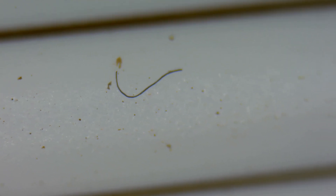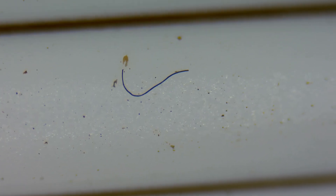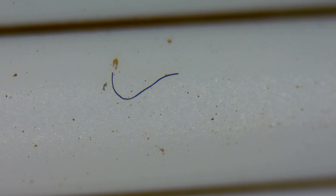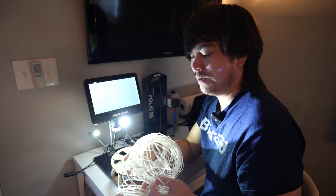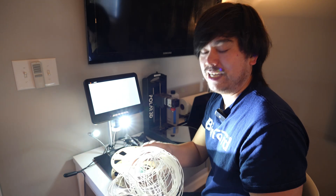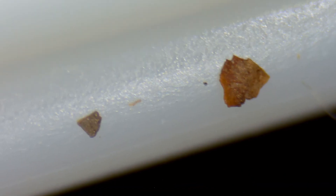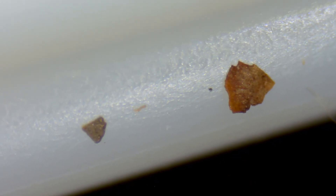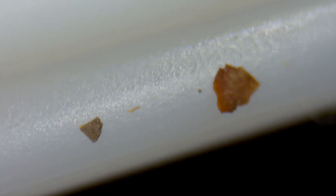I'm going to keep the magnification exactly the same — the framing fills the vertical height of this video with the diameter of a piece of filament, so about 1.75 millimeters. I also have this filament sample that I rubbed around on the floor to see if it would pick anything up. And you can imagine if you dropped your filament on the floor or in the dirt, or left it sitting on your couch — it could pick up a bunch of particles. Yeah, right there — I'm not sure what that is, maybe a crumbled-up leaf. It is around fall time, and leaves are going to have a higher melting point than plastic, so something like that could easily clog the nozzle.